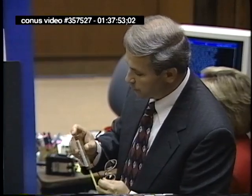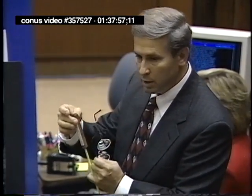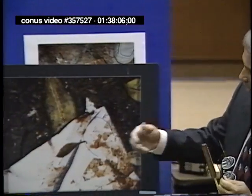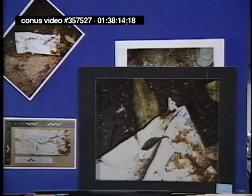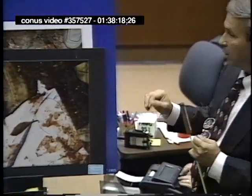And what happens is, when they use these dies, they, on purpose, turn them each time they strike. And they wind up with more of a texture. And there would be no way that they would either try or could accomplish to get these perfectly parallel lines by making it that way. The third method is through chemical etching, and that's more for texturing, like the texture on the face of this Elmo projector or the dashboard of your car, and that's a very, very fine pattern. It would not have parallel lines at all.